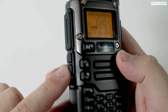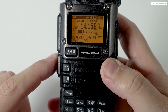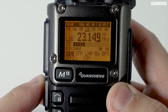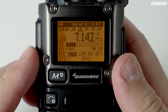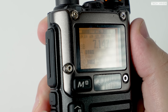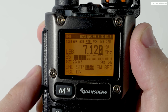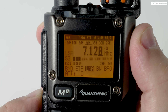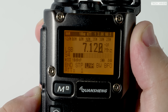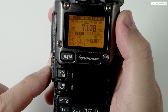With the BND menu item selected, pressing the side keys cycles through the shortwave and HF radio bands. The steps only go as low as one kilohertz, which can be a problem if a station is between frequencies — so you can use the BFO option to tune them in perfectly. The LNA has some attenuator options and an AGC setting. I had mixed results: sometimes AGC on worked best, other times I needed to set an attenuator level.